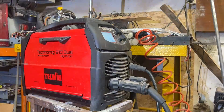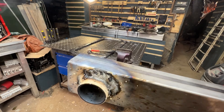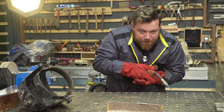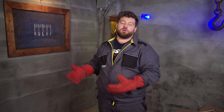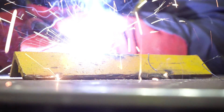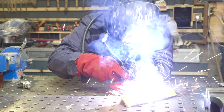I weld the components, making sure not to deform the tube so that the wheels can be pushed inside without problems, and it came out pretty nice. It's so comfortable to wear these gloves while welding — it's the first time. Usually the position for a precise weld is to keep the torch steady so the hands won't shake, but having gloves allows me to keep the hand on the table and keep the torch very stable with my fingers, much closer to the weld without risking burning my fingers.